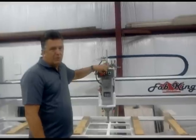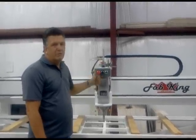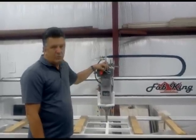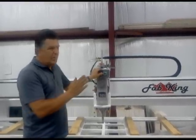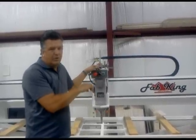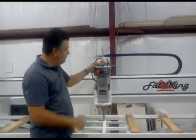Most other options are full counterclockwise or low RPMs to do polishing, drilling. The only time you would go anything different is when you're edge profiling, where you might want to be at 12 o'clock. So again, full speed for cutting sinks, 12 o'clock for doing edge profiling with your diamond tooling, low speed for everything else, drilling, polishing, or whatever you're doing with the machine.